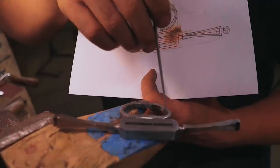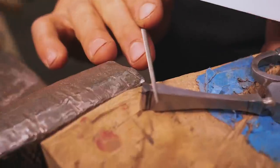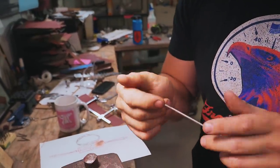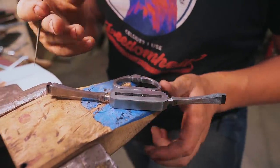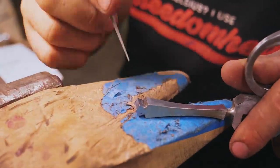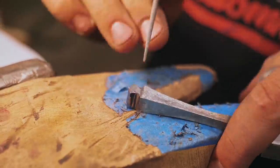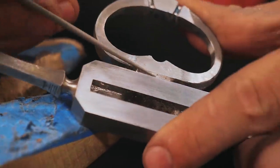Now that I've cleaned out the inside of the d-ring, I'm going to go ahead and add the fuller that separates that last little pentagon from the end on these quillions. I'm going to do that with a round file here — hopefully it's got a fine enough tip. I'm going to have to pull back that shoulder a little ways on both of them, and also thin down the tip of that a little bit. I'll probably start off doing that and then move into doing the fuller all the way around.